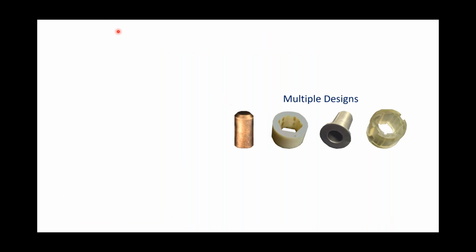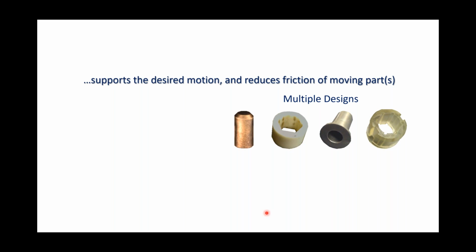And when we look at discharge bearings, there are varieties of them used in a variety of different submersible pumps. Some are made out of ceramic, some are made out of plastic, some are made out of rubber. These two bearings here are like sleeve bearings. This one is, in fact, a closed bearing, but it's made out of a plastic material.